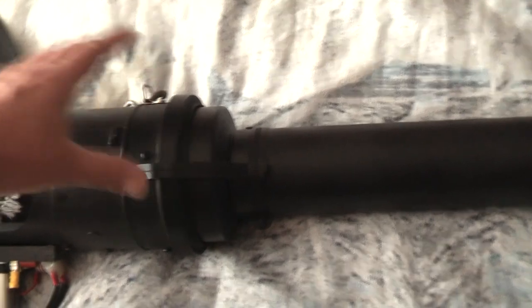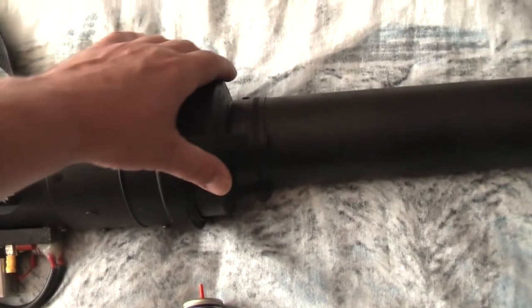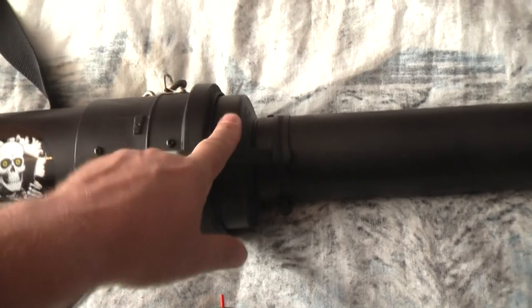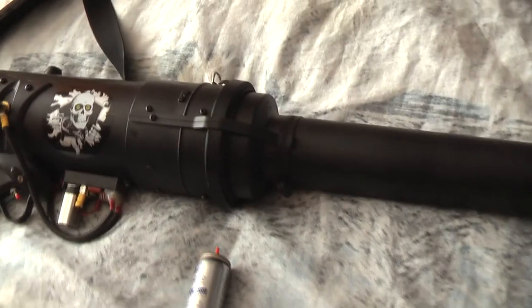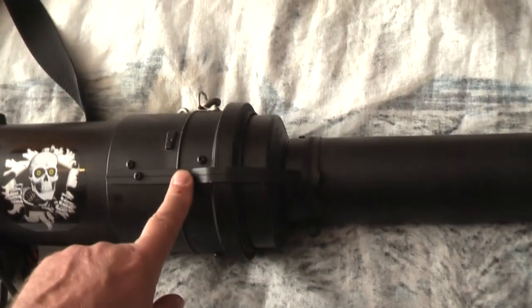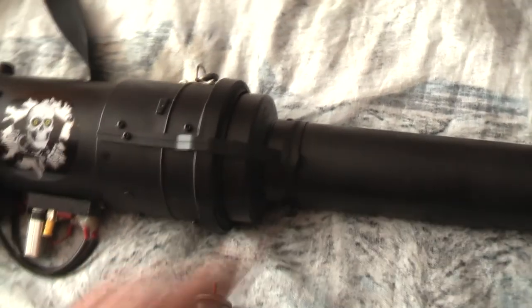The barrel is secured to the breech via a 68-110 plumbing coupling. And I've used all plumbing on this gun. That's just a standard reducer, which is PVC. I've chosen PVC because it's a really strong plastic. I've got a Jubilee clip and two restraints either side of the barrel coupling, and some screws holding it on. That's never ever going to come off.